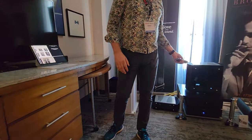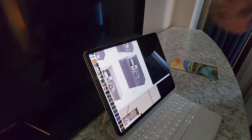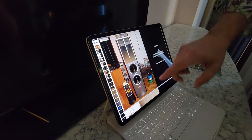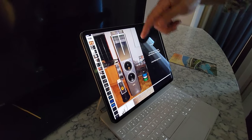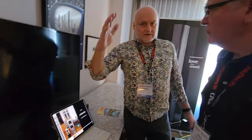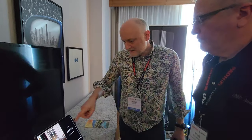It's here. If you don't mind, I'll tell you in a second. Please do. Look, this is our design from the 80s — that's when we started designing speakers. We had all that front firing stuff: front firing bass, mid-range, and drivers that we bought at that time. These are built by ourselves, and you have that hole here — it's a horn. That was our flagship model at that time, with satellite for mid-range, woofer, and tweeter. So 12-inch drivers, and you see that horn. It's a horn that does the following: if you open the door and walk out, you hear all the sound. If I close the door just to a slit, you will only hear the bass outside because only the bass forms spherical waves. By the width of the slit, I define a crossover frequency. In simple terms, the width of the slit of the door is a low-pass filter with a slope of 4.5 dB. And this is exactly what we have here.